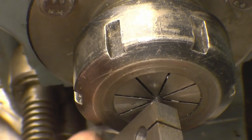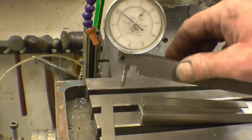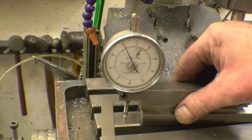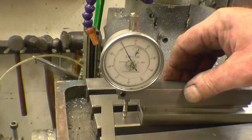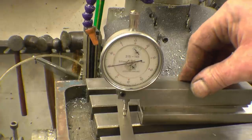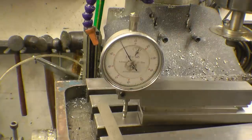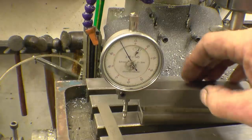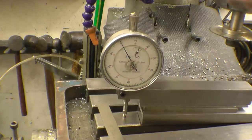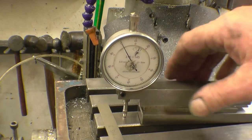That's nice. So you would set this up on your cylinder block - ideally you'd have a dial that gives a lot more resolution than that. Then you bring it along on top of the liner that's protruding out of the block and you get a direct reading of how far the liner is actually sticking up. Quite simple but very accurate and very effective. I'll cut it to length, dress it up, put some nice chamfers on, polish it, and then it's ready to go. And that'll basically last forever - there's nothing to go wrong, no batteries to go flat.